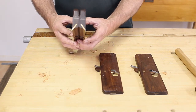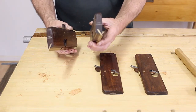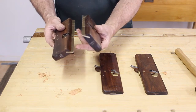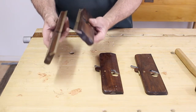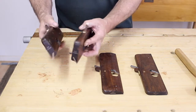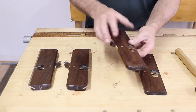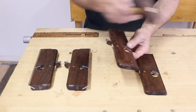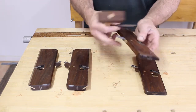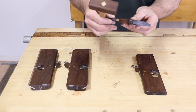The first thing you'll use is a pair of snipe bills — right hand and left hand. An improvement we've made to snipe bill planes is we've boxed the sole in brass, because it does wear; if you've ever seen any old wooden ones they do wear quite badly on the sole. We've also used a brass abutment to make it easy to remove the wedge, take the blade out, sharpen it, and it also makes it easier for setting up.